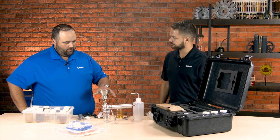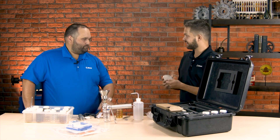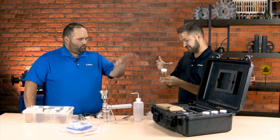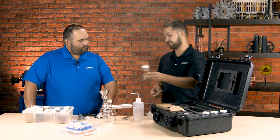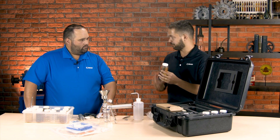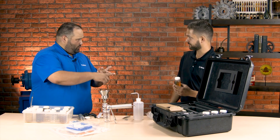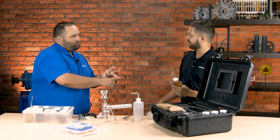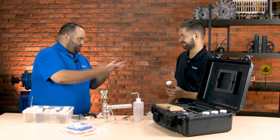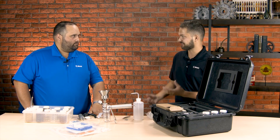That's a pretty robust kit. Is there anything you'd add to this? I like using the Durbin method, which is where you use a magnet like this. You take your sample and put it on there, and this keeps the ferromagnetic particles — draws them down and holds them. As you pour the fluid through the funnel it keeps those particles on there. Then on the second patch — you do this twice — you actually remove the magnet and it'll keep those particles that were attached to the magnet. So the first patch is going to be contaminants, dirt, debris. For example, if the sample came from a worm gear, it'd be brass and bronze on the first patch. Then you move the magnet away, replace with the second patch, and now you get the iron — everything ferrous. So you have two different patches to compare: non-ferrous and ferrous materials.